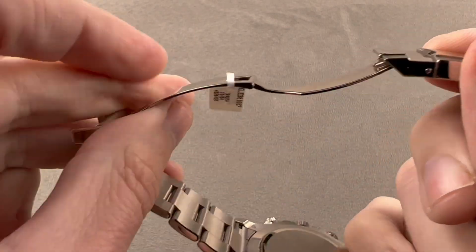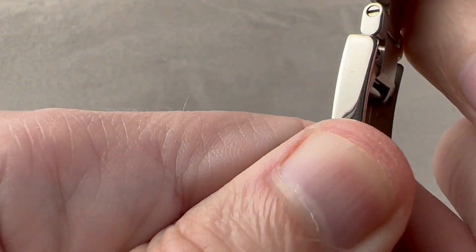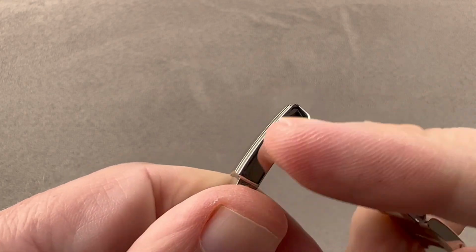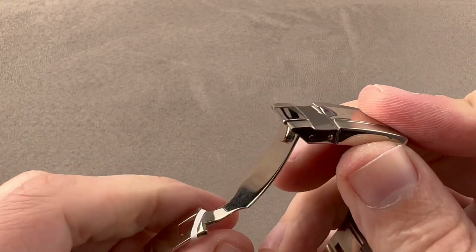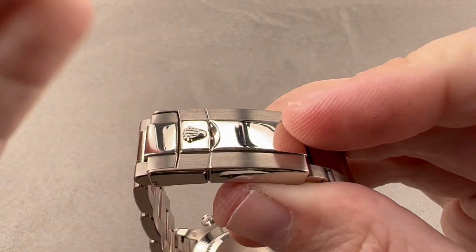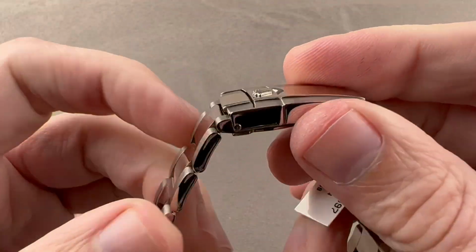Although this is a pre-2009 version of the Rolex Daytona clasp, it does include the 5mm Easy Link system, so it has that in-out tool-free adjustment, and as you can see internally, it does include 3 divots, so you can change the anchoring point by popping the spring bar, and with your strap tool, you can change the anchoring point of the bracelet inside the clasp. Now, where this clasp is a little bit different from the later clasps is that it doesn't have that second locking factor. It has a snap-shut system, and then it has a clamshell lock. After 2009, the clasps would have a combination of a spring-loaded beak and hook lift lock and the clamshell, but this watch just has the one.